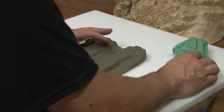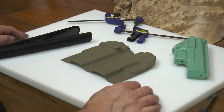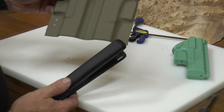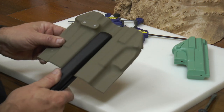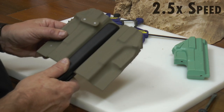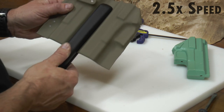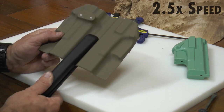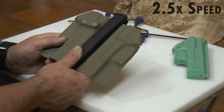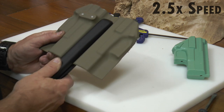This Master Series setup is a really good deal because normally what you would do is have some type of split mold that you would vacuum form on, and then you would need a full mold to be able to fold it in half. We're simply using a flat iron here to heat the center — we want to get it nice and soft. This just allows us to fold the holster over. This is a very inexpensive way to do this. You can get a strip heater if you're more advanced and making a lot of holsters, but if you're doing this as a hobby, this is a pretty inexpensive way to get into it.